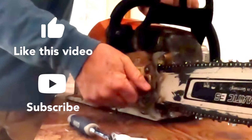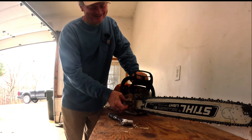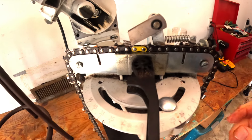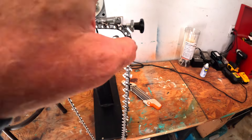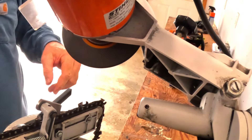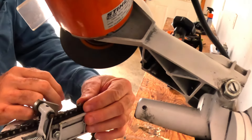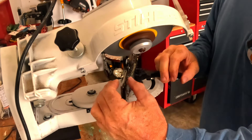The 500i is pretty cool because the nuts are trapped in the cover plate — how many times have you dropped your nuts? You never want to drop your nut, even if it's a chainsaw. Let's go ahead and put it in the old vice here. You have this stop — you pull the tooth back until it stops and then you clamp it. You want to set your travel, which is set by this adjustment. So it bottoms out right there. Now I'm going to go forward a little bit and touch the link.